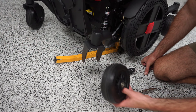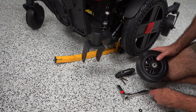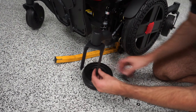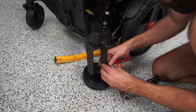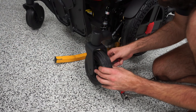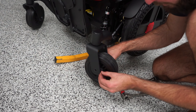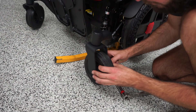Getting the tire back on is a little trickier. I recommend getting a small screwdriver to help you out because getting the washers lined up on the inside is tricky. What I recommend is to take your screwdriver, put it through the hole, put on your washer, put on your tire, then push that screwdriver through, and try to stick the second washer on the tip of the screwdriver.